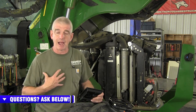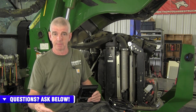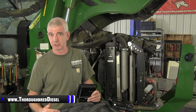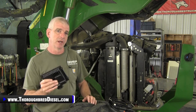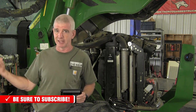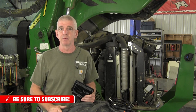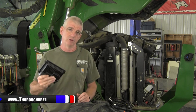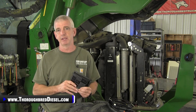Back to the farmer that maybe has one of these on the farm just for a utility tractor. I roll a bunch of hay. My hay roller is rated for a 75 horsepower tractor — it would work perfectly with this tractor, but in heavier hay and hilly conditions, it can pull that tractor down. That's where a module like this would really come into play. If I had this tractor on my farm and I had a breakdown on my big tractor, I could hook to that hay roller and run with peace of mind, knowing the tractor is going to handle it and perform flawlessly because of the power increase.